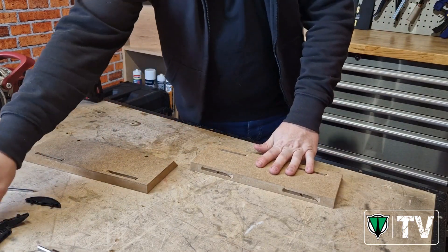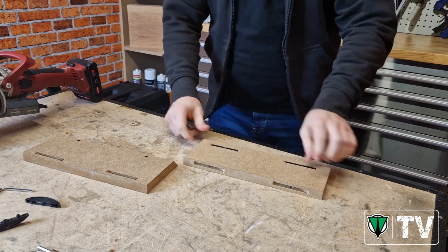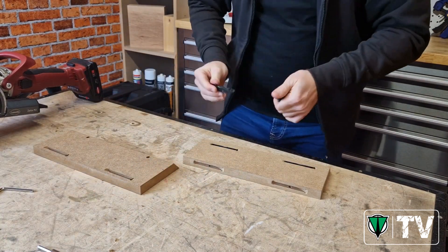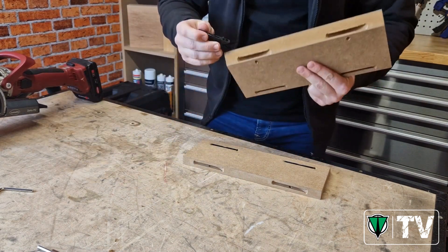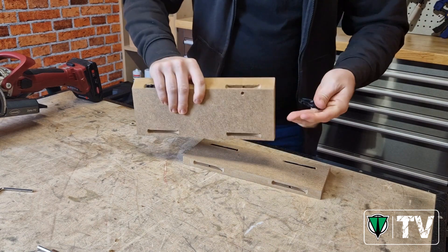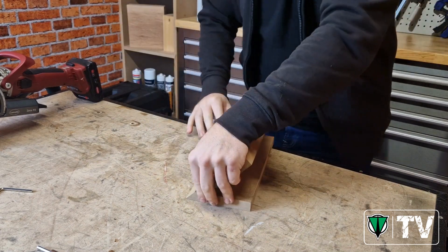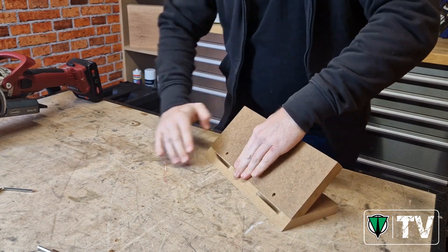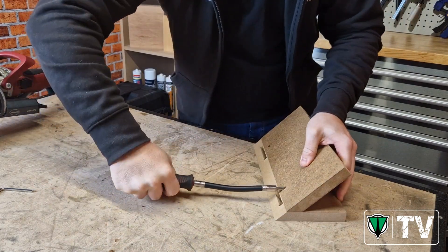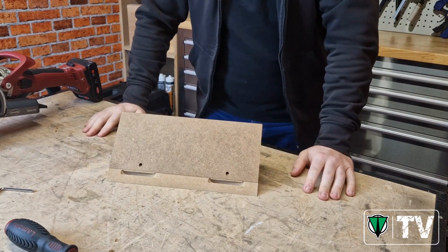So now we've got these joints. As this face is flat, we'll put the female connectors into the top here — that way, should you make any furniture that needs to be transported or flat packed, you can stack on top of it. If we were to put the male connectors in there, they wouldn't be able to be stacked. I have gone ahead and pre-drilled the holes on the back so when we come to put them together we can access it. We'll get the Allen key hole matching up with the hole I've drilled, and the same on this side. We'll offer these up, get the lateral lined up, and grab our Lamello Clamex tool and give that a twist. And there you have it — one 45 degree obtuse angle using the Lamello Clamex connector.